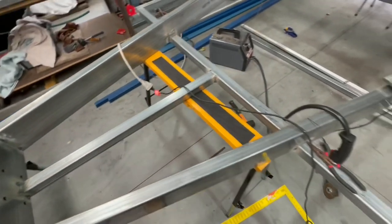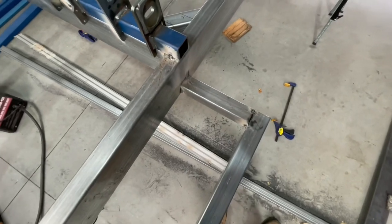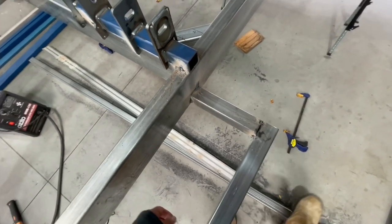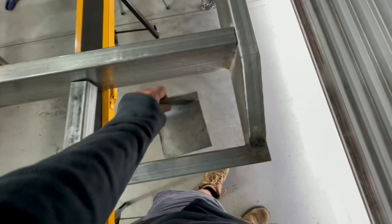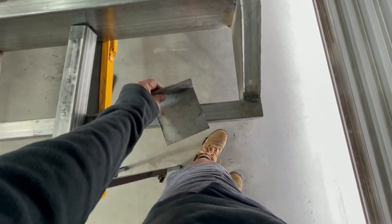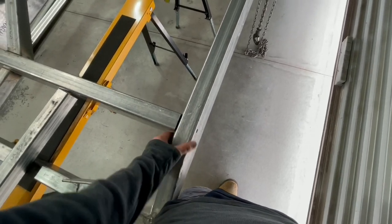Put that section in, tacked it off, ready to weld. Knock that out, cut it back a couple of mil, put it back in. She's right on now, spot on all the way around, exactly the width I need. I'm just about to tack these in place. They're the corner steady brackets that'll go in there. Also offer a bit of strength here at the back where there's going to be a bumper bar hanging off with the wheels on it, so that'll strengthen up that joint a bit.